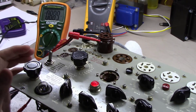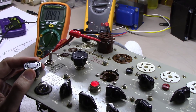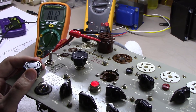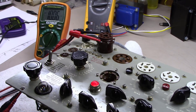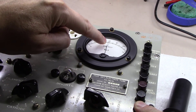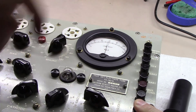I'm going to let this warm up for about 30 minutes or so, just to let everything warm up well — I'll pause the video here. You want to get this thing slightly over 10 volts, between 10.05 and 10.10. I'll back it down just a hair — right in that 10.06 range. Then you depress the line adjust button and you're trying to get the meter to the very center at that point with that 10.05 volts.